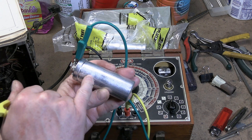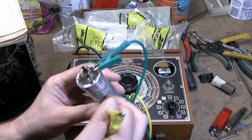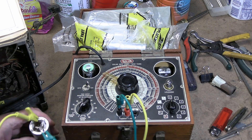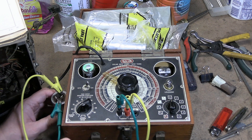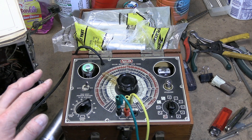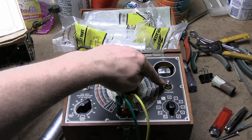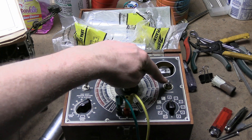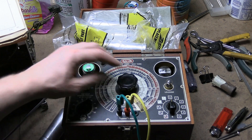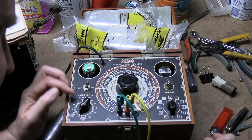So we have an 80 at 350, and 80 at 350, and a 15 at 350. Let's do one of the 80s. The can is negative, the lug is positive. I'm in the electrolytic mode. We're going to observe a few things. One, we test for leakage — if this light flashes it indicates there's leakage; the faster it flashes, the more leakage current there is. When we check the capacitance, we check for the eye opening as we rotate the dial and read the value off of this. So let's check for leakage first.